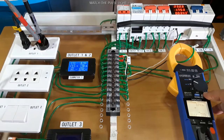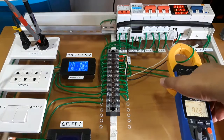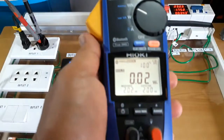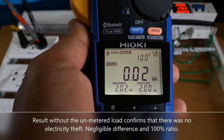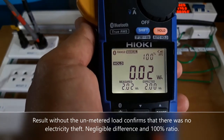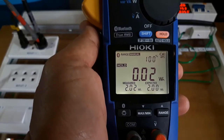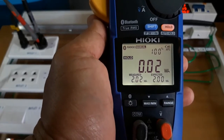That was a start, so we are now waiting for the next pulse of light to stop the measurement so we can compare the values. That was the second pulse — let's compare. I have a measured value of 2.02 watt hours against an expected value of 2 watt hours. This is a good result, confirming that the energy meter is properly working. Now we are going to simulate a situation where a load is connected that does not pass through the meter.